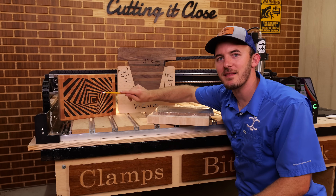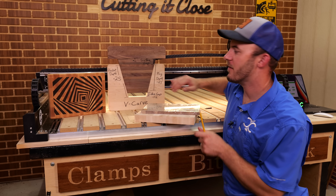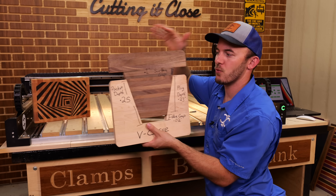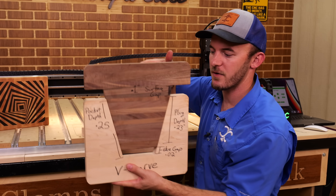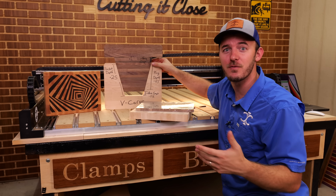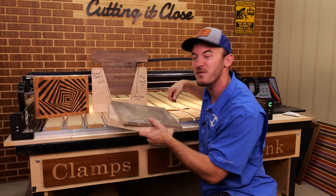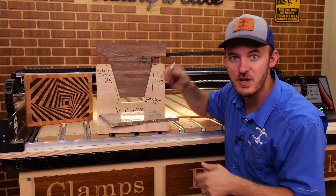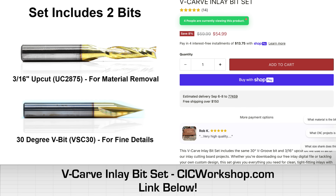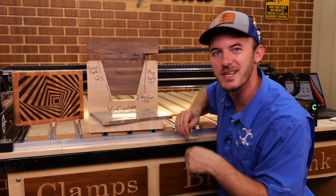To make this 3D illusion cutting board, we're going to use the v-carve method of inlaying. I did a full in-depth video on that, so I'll leave a link in the description. For today, you don't even really have to know this because you get the digital file that already has all of it done for you. Just know you're going to need a v-bit — we'll be using a 30 degree v-bit and a 3/16th upcut bit from the v-carve inlay set from CIC Workshop.